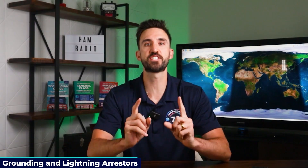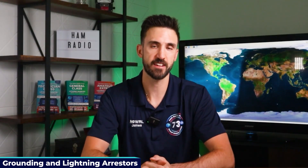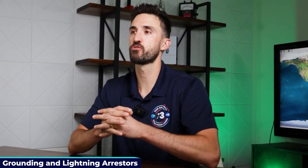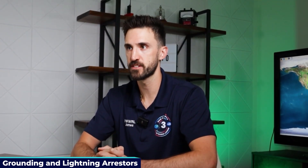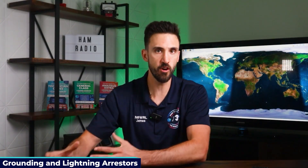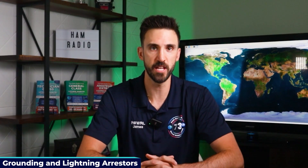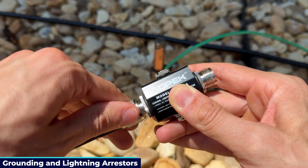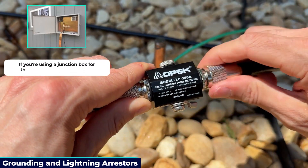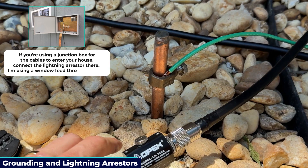You need to install a lightning arrestor in the coax between the antenna and your ham shack. The lightning arrestor also needs to be connected to ground, and since the coax shield is connected to the device, this also grounds the coax shield, acting as a ground block. It's a critical component — it acts like a fuse in the event of a lightning strike, cutting current away from your station and into the ground rod. Connect one end of the coax from the antenna into the lightning arrestor, and the other end going to your ham shack. I'm installing it near my dedicated ham radio ground rod, close to the shack entrance.